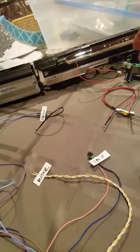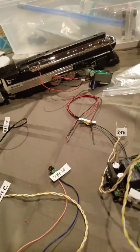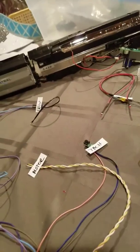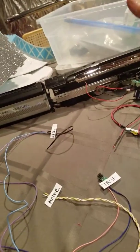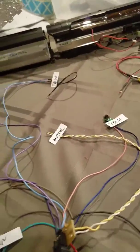The other thing it can do, since we have our tach and we know what a revolution is, and we have our stripes, is count 4 per revolution, and every 1/4 of a revolution make a noise. So one, it makes a noise through the speaker, and 2, it turns the fan on and makes it puff. So you get the puff and the chuff at the same time, all using the stripe and the tachometer on the motor. So that's valuable.